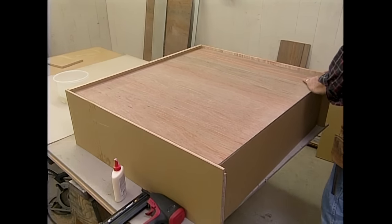That half-inch hole is so I'll be able to access the adjuster screw on the leveling feet — a little bit of glue on the block, a couple screws. At the front of the cabinet there's a filler that goes down to conceal the leveling feet. This one-inch spacer, which will go between the cabinets, is so that the flip-up top will clear this extension. Another spacer at the back of the cabinet. Let's see how it fits — slide it up against the other cabinet, attach it with some screws, and then I'll level up the feet.